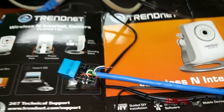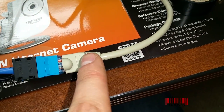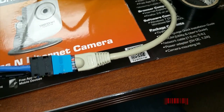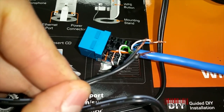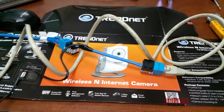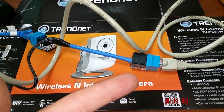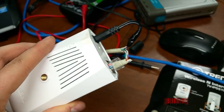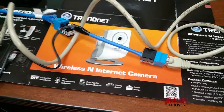Whether you're using a single cable or the female-to-female setup, make sure you don't send any power back out the switch end — break the connection and only use the camera end of the wire to inject power. We're going to solder the pins together, positive and negative, exactly the same way as before. It's all done, taped up, soldering complete. Basically we're turning your Ethernet cable into a glorified extension cord. Here's what the back of the camera looks like — all taped up and ready to go.